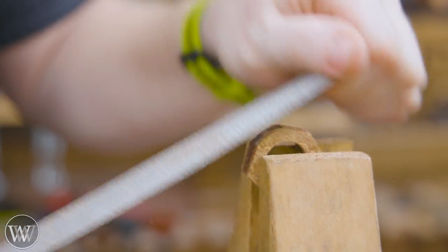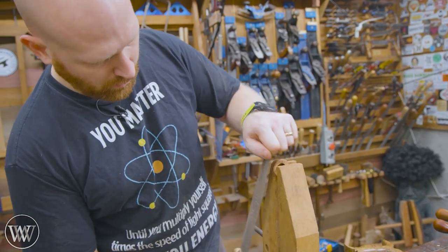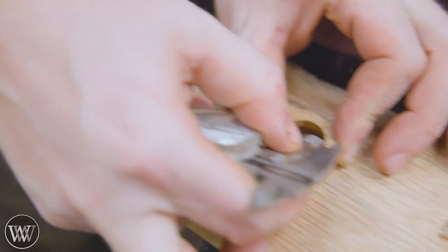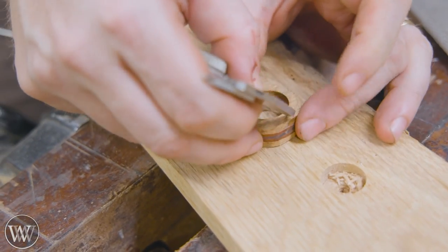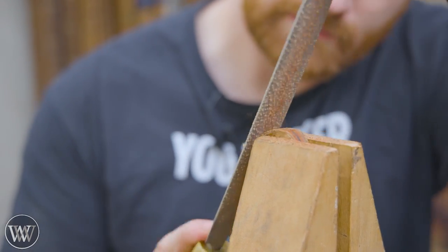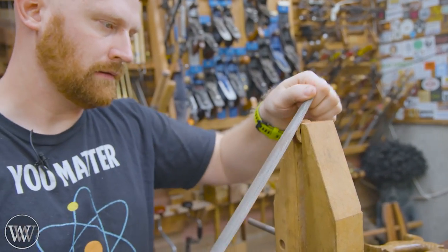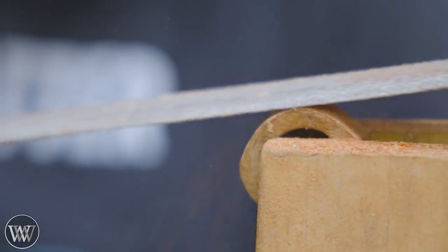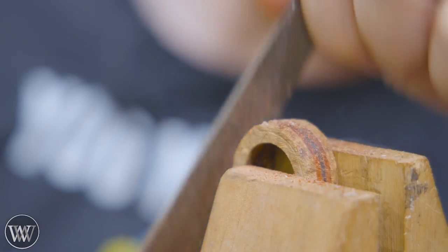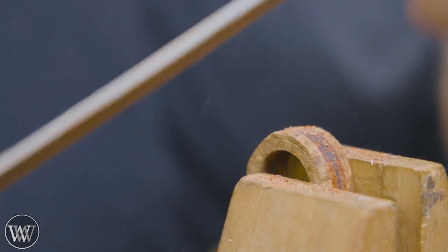I ended up making it just over an eighth inch thick. That's a little thicker than most people like it, but Luke has big hands and it actually felt pretty good to him. I'm going to use some calipers to mark in from the inside all the way around about how thick I want it to be. You get that little line on both sides and then come in with the rasp and rasp it down until you just touch that line on all sides — this lets you know you're really close to round. The rasp gets you close to where you want to be, and then the file comes in and details it. You also want to use this movement where you start vertical and then rotate across — if I'm getting close to my line, I rotate the rasp as it comes up and over the ring for a nice smooth surface.